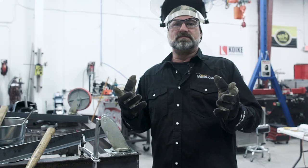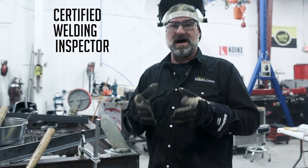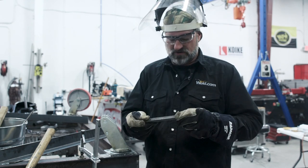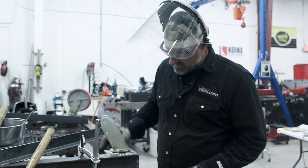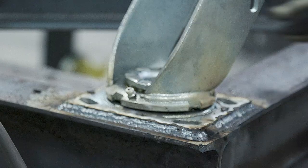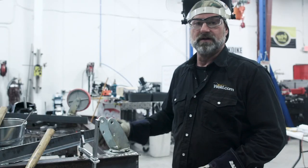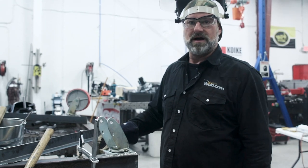As you can see, we've got it all cleaned up. I've been a CWI for seven years, and I like to see nice, clean welds — I don't like to see a bunch of BBs and all that stuff. That's why the chisel right there is a structural welder's buddy — it'll knock those BBs off. I like it wire-brushed and cleaned up. If it's got a little blemish I like to hit it with a grinder and make it look very presentable, just like this weld does. The profile looks really good, and that's what I'm looking for from a CWI perspective.